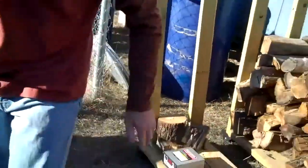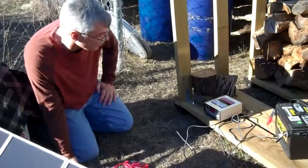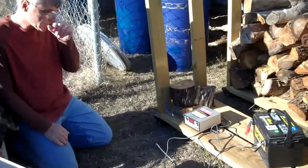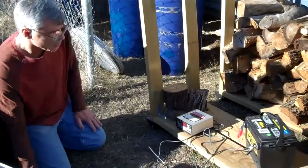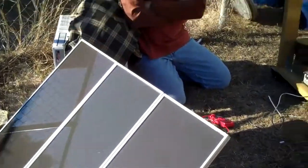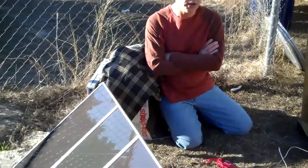I wonder if that's reading from the battery directly — I think it was feeding back in because that battery should have been charged up. What the controller is showing now is about 13.3 to 13.4 volts, bouncing around a little bit, showing that it is charged. This makes sense because we've actually had this connected up for a couple of days charging that battery — we just took it all apart to make this video. When we first connected it, the battery was down around 12.7 volts. After charging it overnight, it had gone up to 13.3. So it does work.